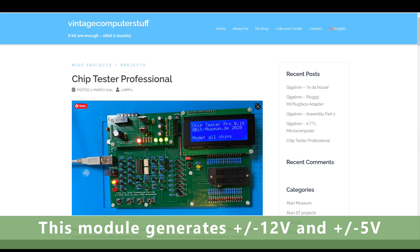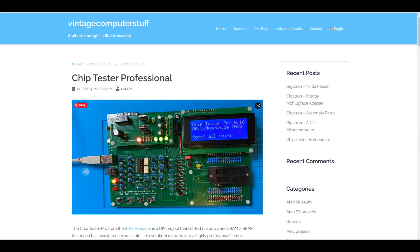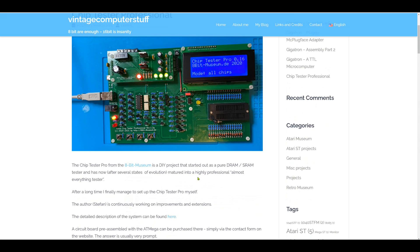A little bit about the architecture: there's a plug-on board here that I believe is doing boost conversion. It uses a four-line by 20-character LCD display output. There are three switches you use to control the system. There's a large number of parts — this can test lots of DRAM, lots of SRAM, logic, just all kinds of stuff. It uses a zero-insertion-force socket that supports both 300 and 600 mil parts. That's important — if you only get a 600 mil socket, you can't test DRAMs or logic.